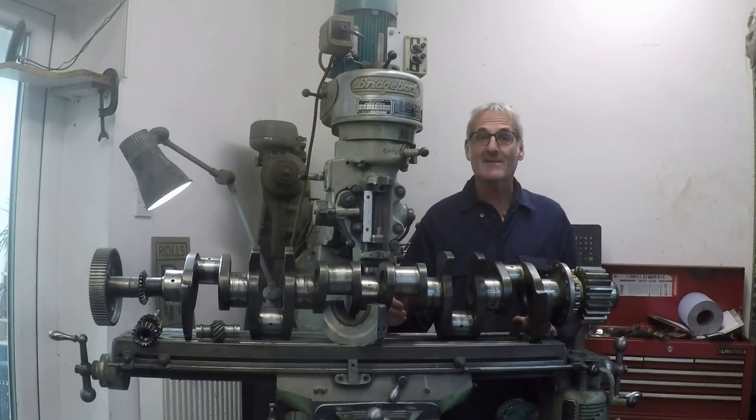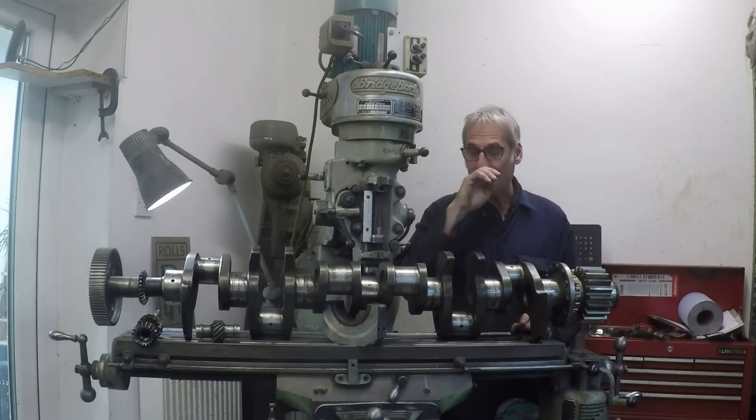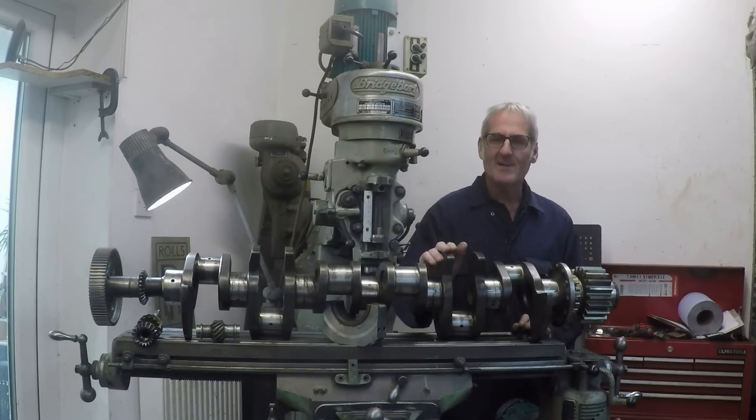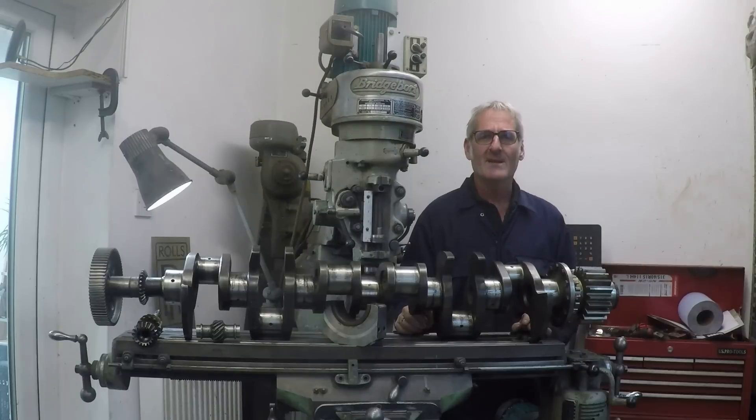Hello and welcome back to this series of videos about rebuilding a Rolls-Royce Merlin engine. I'm going to talk about something slightly different this time before moving on to rebuilding the wheel case in the next episode. During its service life the Merlin was generally very good at doing what it was designed for and didn't really have very many problems. The two main exceptions are the negative g effect on the float carburettor, which I'll talk about in another video, and something called skew gear failures, which some of you will have probably heard and read about.